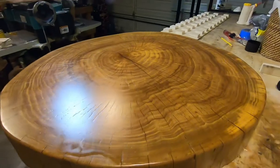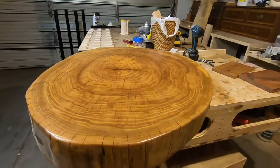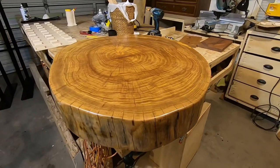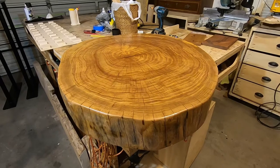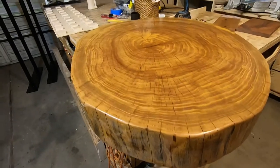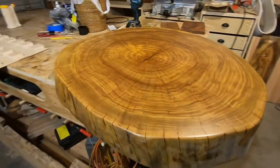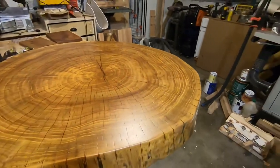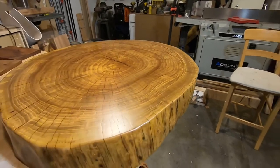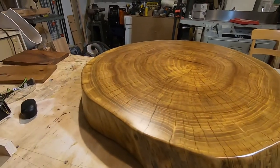I know this video was a little long so I apologize, but hopefully you've picked up some good tips and tricks. If you have something to share, I always encourage positive feedback in the comments on what works for you. My plan now is to slice off this top piece with the bandsaw mill, wrap the whole perimeter in Tyvek tape, and do a standard epoxy flood on the top. What I found works really well is leaving the epoxy containers on your floor furnace vents so they get nice and warm without getting too hot — then the epoxy floods pretty easily, hopefully filling in all these cracks. Hope you picked something up from this one — have a great day.